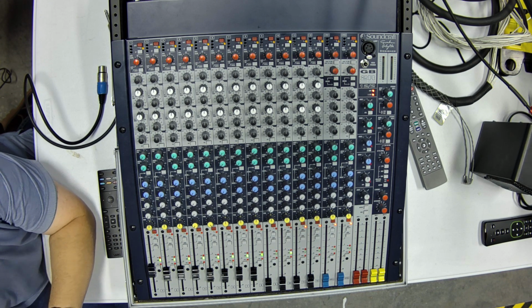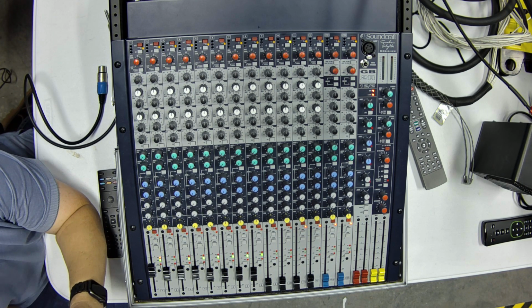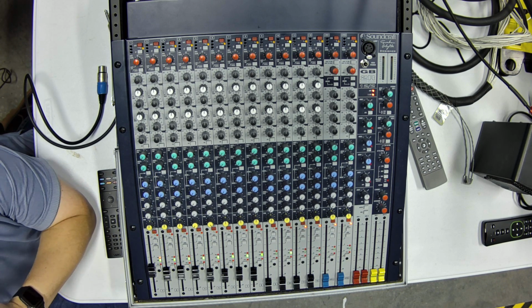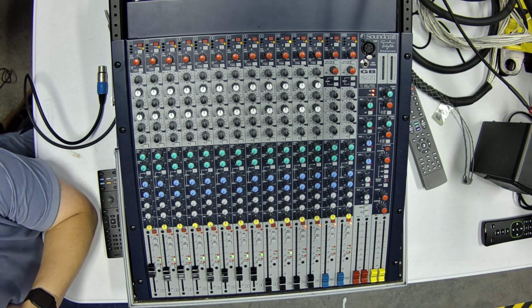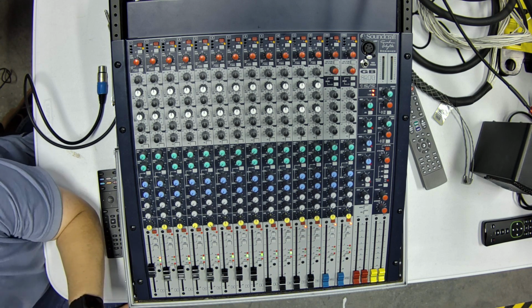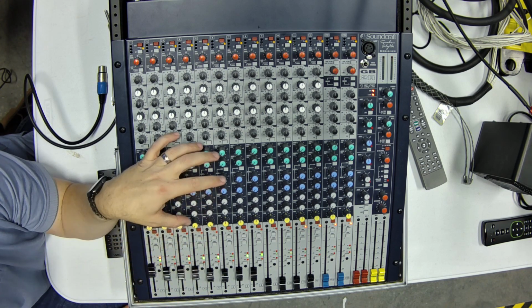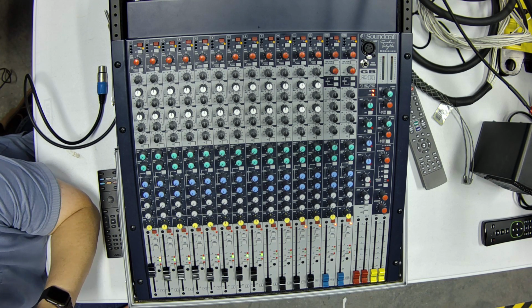Because to do that shift of phase, that involves manipulating time. You have to move that wave in time somehow so that it starts in a different spot. Or you pick it up in a different spot. But either way, it involves waiting or manipulating time. And that's really, really hard to do in analog circuits, turns out. It's really easy to do with digital circuits. Manipulating time in the digital domain is easy. But manipulating time in the analog domain with sound is really hard. Once upon a time, we would do it with tape, with that magnetic tape.